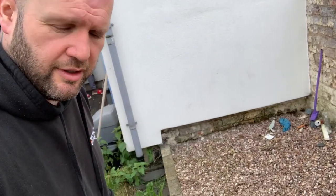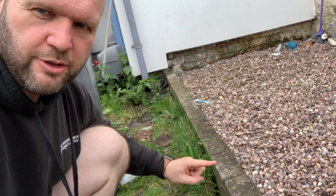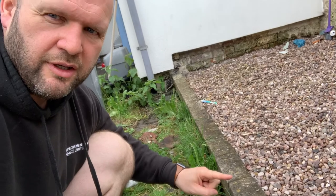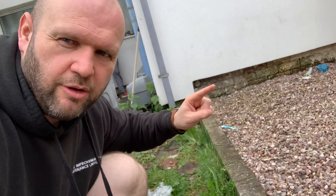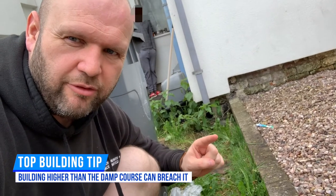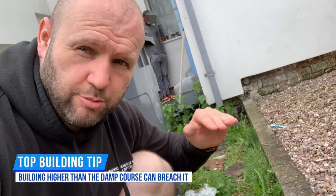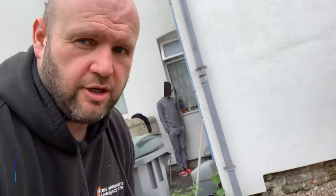What could be the issue - can you see how this has been built up from the floor? It's raised up, and as you go along there it means the height of this is higher than the ground level inside. So it's probably breaching the damp course, and that's going to create rising damp.